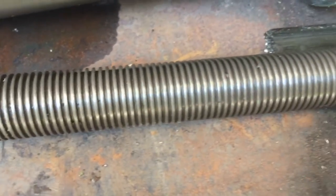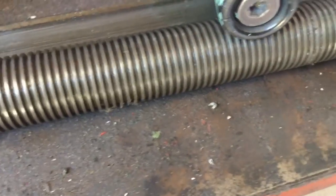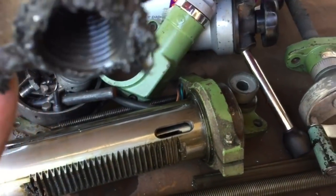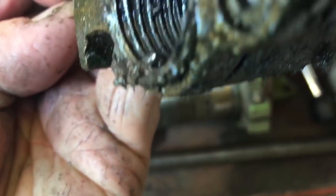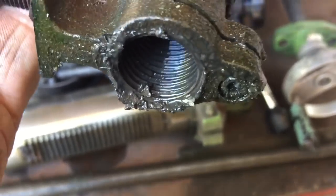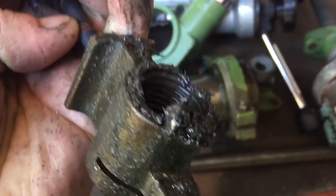All the original machining marks are still visible on the casting, which reinforces my belief that this was basically just used as a drill press. The inside looks pretty cool. Pulled the quill out for a thorough clean and inspection. Looking at the X-axis feed — naked eye inspection, which of course is really accurate — looks like it's done nothing. A lot of dirt, but plenty of take-up left in that as well. A little bit of wear maybe. Might change that out to a split system to try and improve backlash.